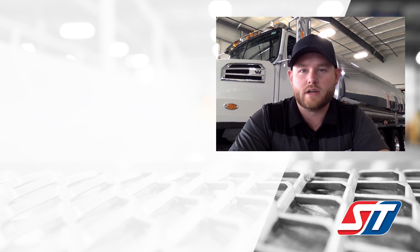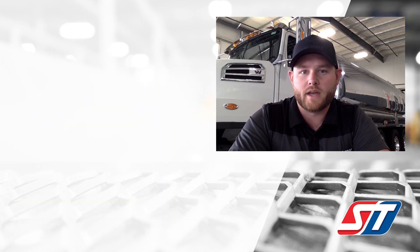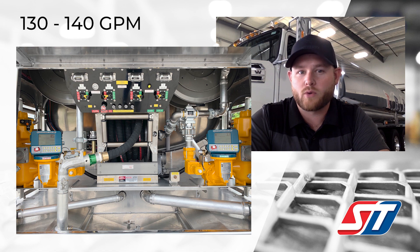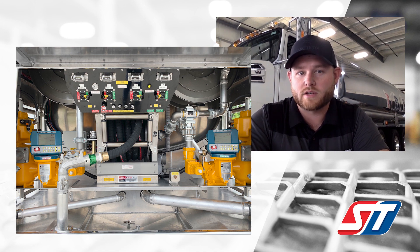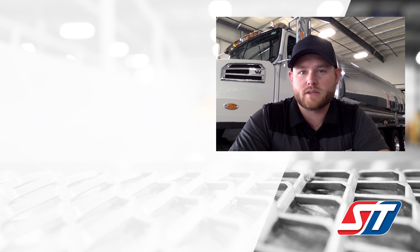Think about how often the fuel trucks in your organization need to pump more than 90 gallons per minute. A standard system with 2-inch piping, 2-inch dry brakes, and a 2.5-inch fuel pump will get around 90 to 100 gallons per minute using a direct pump off, and a little less using the hose reel. A standard system with a 3-inch air manifold and a 2.5-inch fuel pump will get around 130 to 140 gallons per minute on a direct pump off and around 120 gallons per minute using the 40-foot 2-inch high-speed center hose reel. If more speed is needed, we pair the 3-inch air manifold with 3-inch piping and a 3-inch pump to get 170 to 180 gallons per minute. Keep in mind the manifold system can always be used at slower speeds — it's just that the dry brake system cannot be used at the higher speeds.